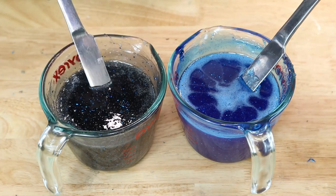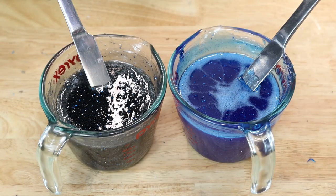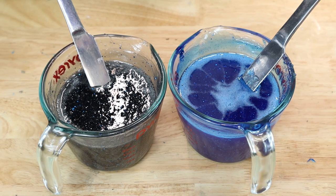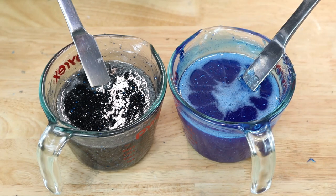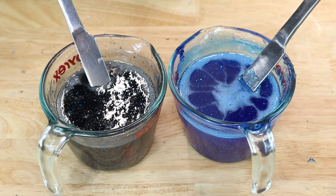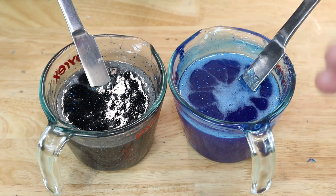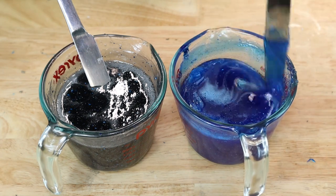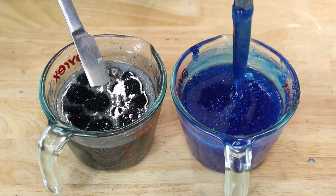When I add Plastisol to plastic that's already been heated up past 350, I like to do it every minute, pull it out, stir it up. I like to get it over 350, just that way I know 100% that it is cooked, and then I'll let it sit for a minute, stir it every 30 seconds while it's sitting out, and then I'll throw it back in just to make sure that it's all heated up, just in case there's something at the bottom that didn't get stirred up right. I don't want it to fall apart if it's for a customer, because if you don't heat up plastic fully 100%, it will fall apart.